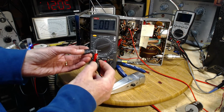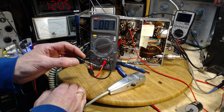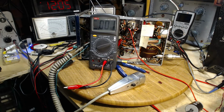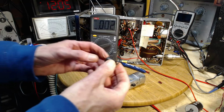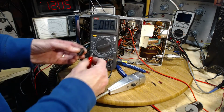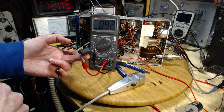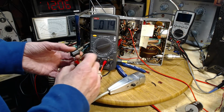So this is a brand new electrolytic capacitor. Any voltage in that? I think you could argue no. And now I will dig into my drawer of old guys here. Let's grab a weird one. This guy's a real high voltage one, I think. No, 400 volts. 27,000 picofarads. Again, the voltage is in there and bled down almost immediately. So it's suggesting there's moisture inside.